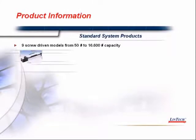The 130 series has a single square rail and 1 or 2 bearings. Dynamic load capacities up to 200 pounds, and the bearings and rails are stainless steel, and the bearings have self-lube reservoir. There are many lead combinations for Acme or ball screw drive mechanisms. Top or side aluminum covers are also a common option.